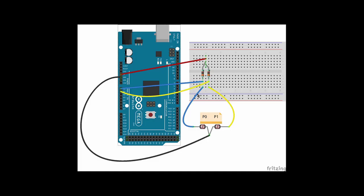Here's a simplified wiring diagram for our counter. Our two photocells, P0 and P1, are tied to pull-up resistors that are 33k ohm each, and those are tied to the 5V coming from the Arduino. The common leg is tied to ground. So when the photocells are covered, they have almost infinite resistance, which means that the pull-up resistors will pull the level close to a 1 — that will be close to 5V. However, when exposed, the resistance goes to about 7,000 ohms, which will drag the logic level to about 1V, and that will show up as a 0 on the Arduino.